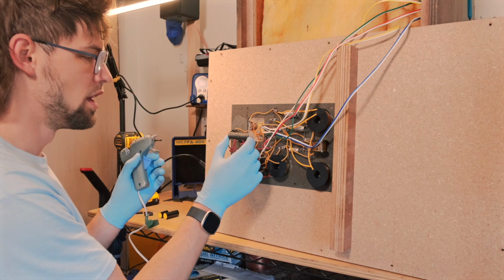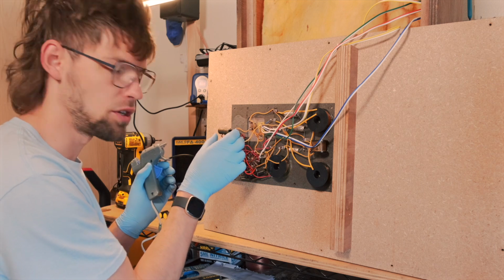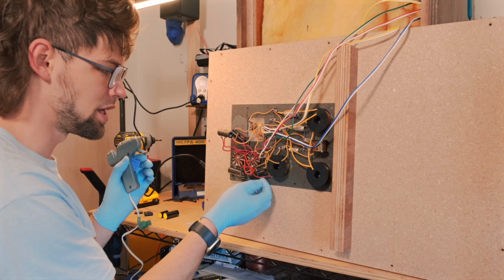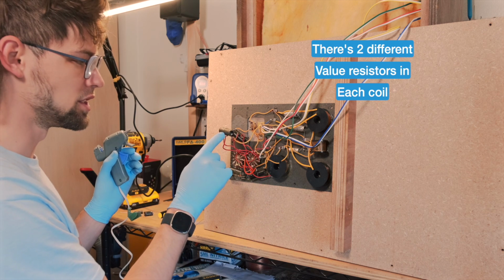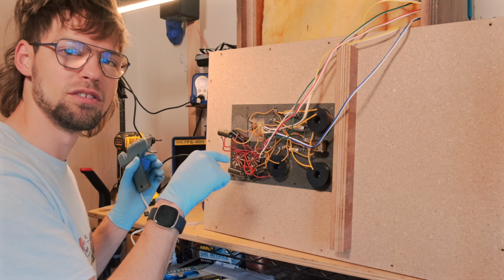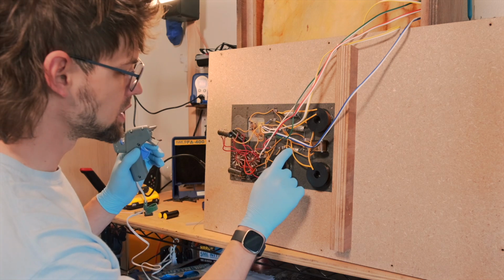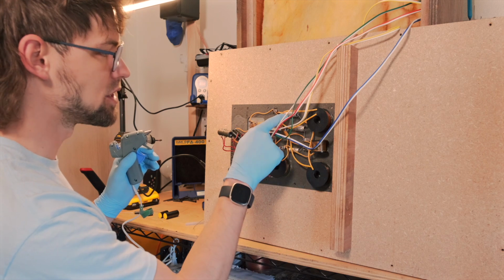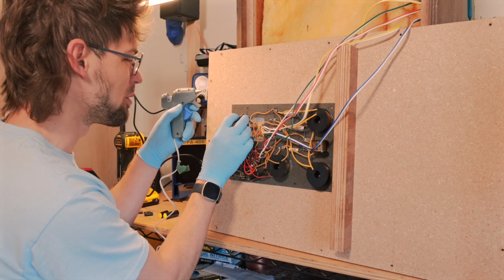They usually won't go bad, and these are also hollow on the inside. Typically that means they're a 20-watt resistor, so replacing these would end up being kind of expensive, because they're also a double, and if you wanted to replace them, the only option would be to get 8 20-watt resistors, which would end up being pretty expensive. So on these, we're just going to be replacing these 4 silver capacitors here. But first, I'm just going to go ahead and hot glue these back to this board.